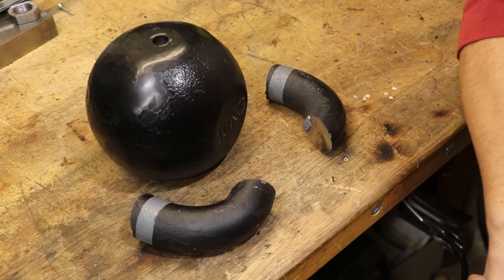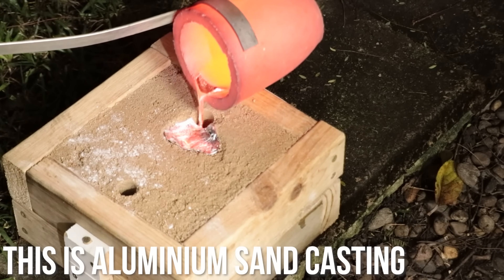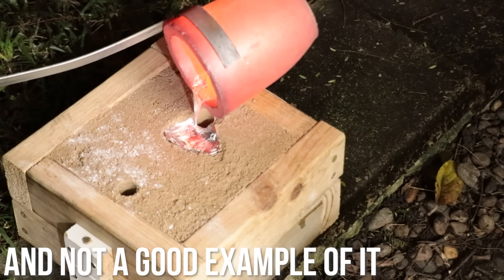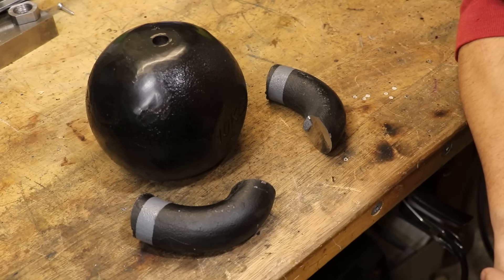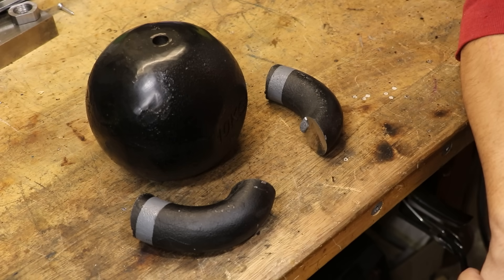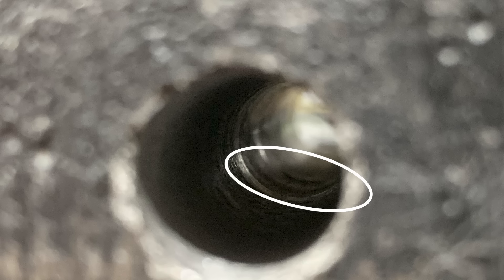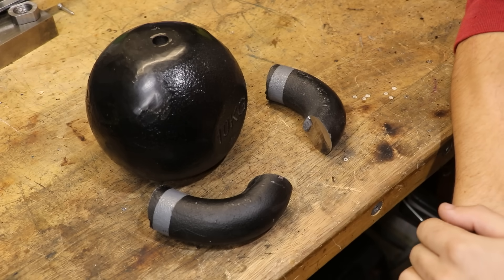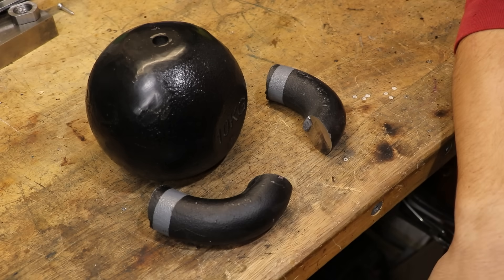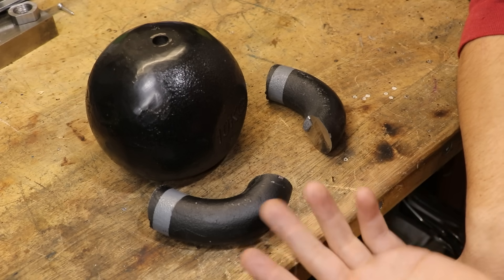The biggest issue with dumbbells is that they're generally made using a sand cast — you make a mould in the sand and pour hot metal into it to form the shape. It's good for cost and speed but generally bad for porosity. There are steps to designing moulds to help prevent porosity, but for something like this those steps weren't taken. Shining a light into this piece I can see three different porosity voids in the sidewall of just one hole. Two are pretty small but one is quite deep. That's just three from this one hole, and the rest really wouldn't be expected to be any better. These voids lower the strength and can cause the part to break at much lower strengths than you'd expect.